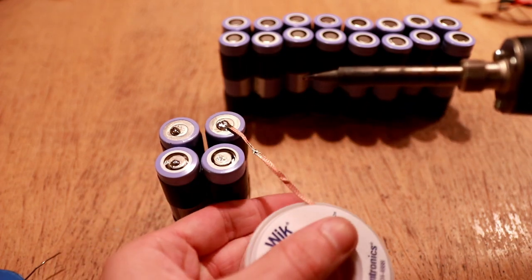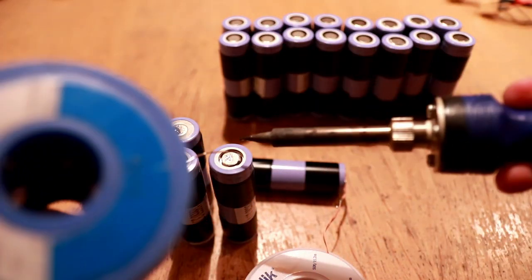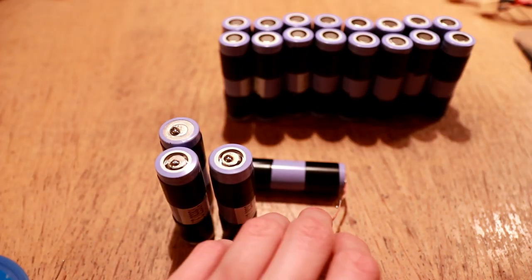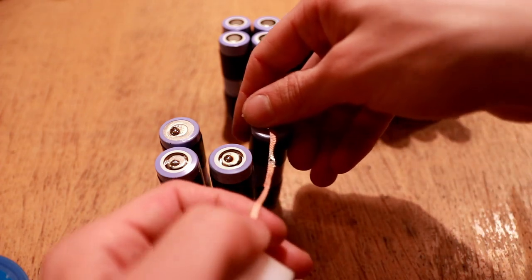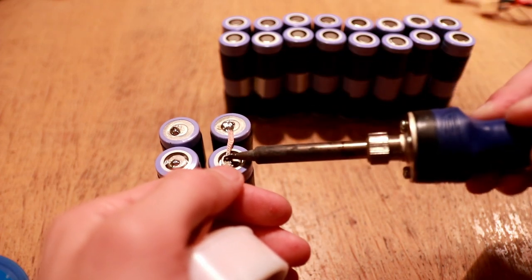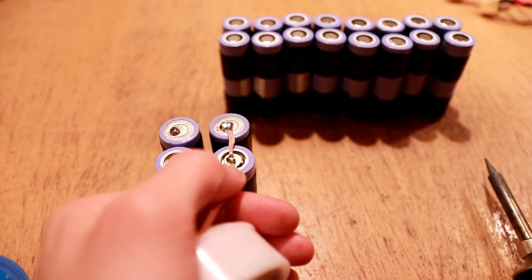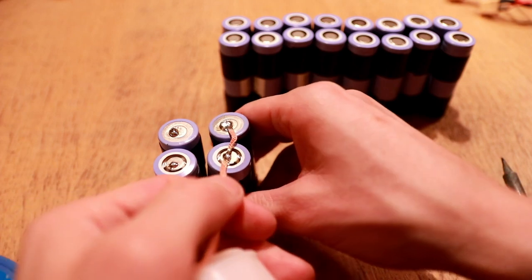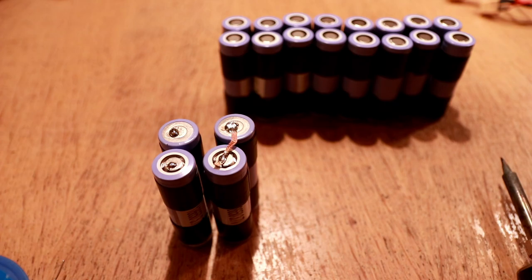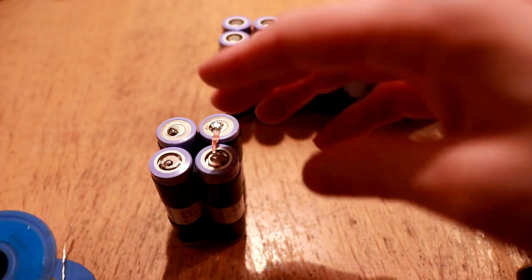That one's not making a good connection so I'm going to add some additional solder and try again. We'll reorient the cell that's tipped over and if all goes well we'll get these to connect. That's a much better connection — you can see it's sturdy and should stay in place. This means we can now trim the wick off at that level and do the same with the other side and then connect them across to bridge the two for balancing purposes.